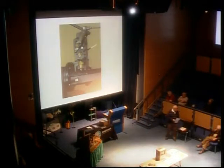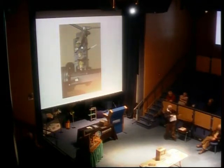What it actually did, it drove the paddles of a dye house at Lambeth, dye as in colouring cloth, very, very light paddles to keep the colour in suspension. It wasn't a high torque job, it was just a high speed job. And it was deemed to develop 6 horsepower at 26 revolutions a minute. And that's how it operated.